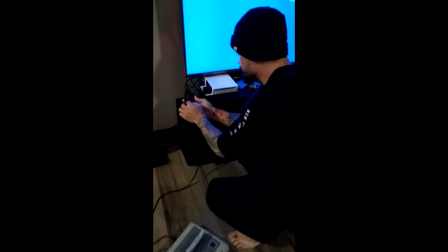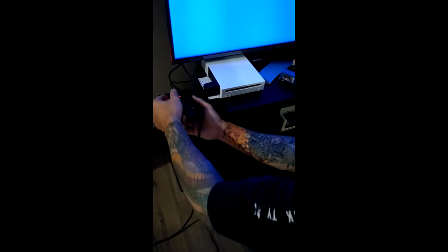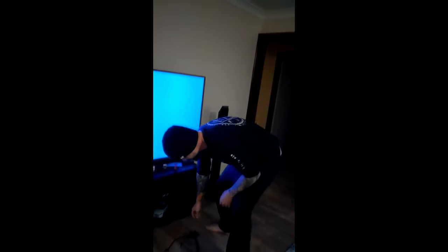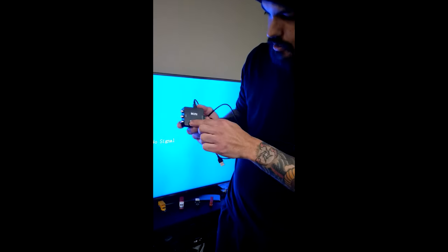So here we have a cheap Chinese — it's basically a SCART to HDMI converter. Looking at it, I sort of had my doubts it would convert RGB-S to HDMI in a little cheap case that small. I wasn't wrong. Although the input is SCART, it only accepts composite through SCART, as opposed to this, which takes composite through RCA jacks.